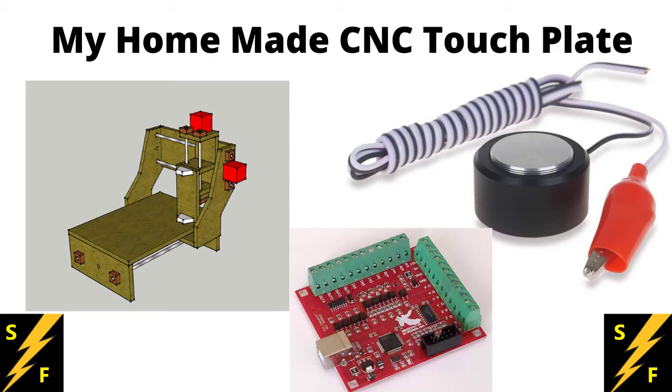I've been busy out in the shop working on a CNC machine I'm building. I just finished the Z-axis, there'll be a link in the description below, and part of that assembly is going to be a CNC touch plate. For those new to the CNC world, a touch plate is used to set a consistent height for your Z-axis. This is ideal when you change a bit.